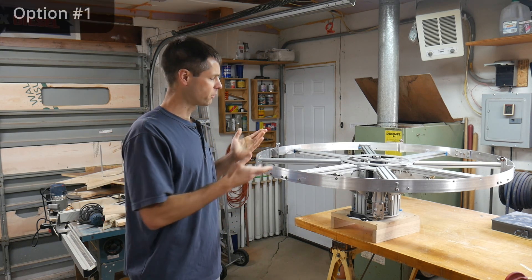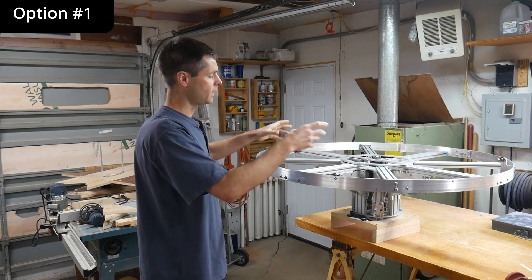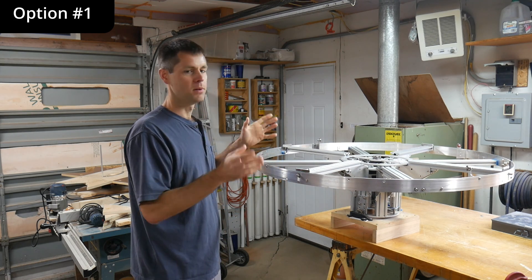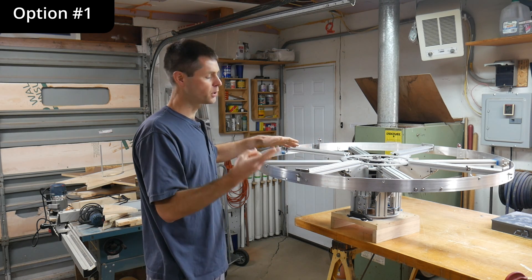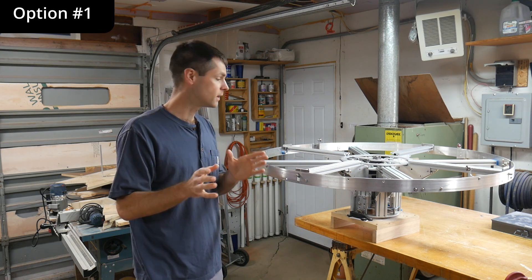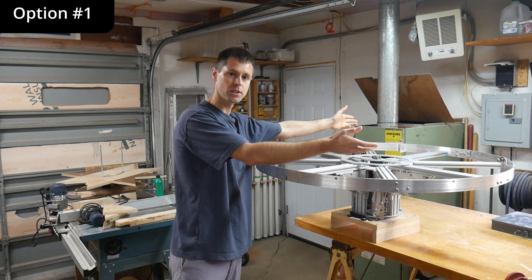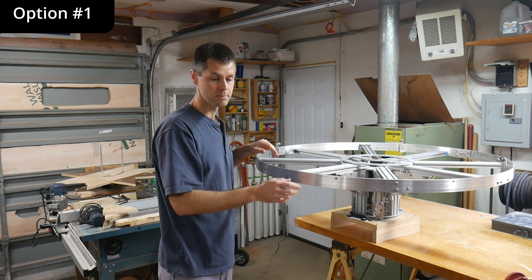What are some of the options I considered? Well, the first one you're already quite familiar with. We have a fixed main hub and then a lifting hub meshed within it. You ride up the ramps and the whole thing lifts. I would call this a global lifting strategy, because the rails go up and they're all interconnected, and there's really only two pieces - that main hub and then the lifting one. So it's quite simple in that respect. You could also have a local lifting strategy where all of the rails are fixed, and there's something on the cart that goes up - independent mechanisms that hopefully happen all at the same time.